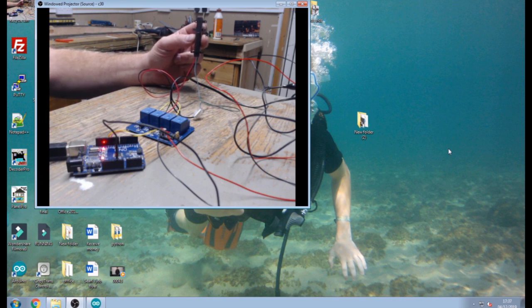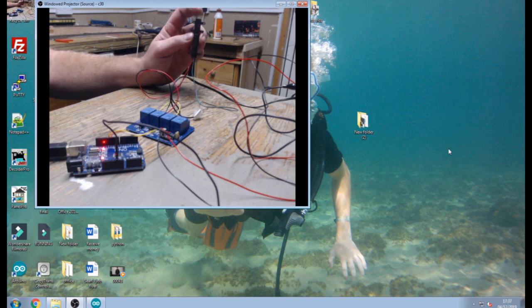These run on 16 volts AC according to the paperwork. I have run one at a little bit lower voltages and I'm going to be trying to run one a little bit lower than the voltage they're putting out, because these still get quite warm even with the amount of pulsing. In this demonstration, it's probably not the practical way because you wouldn't be turning the turnouts on your layout on and off as much as I'm going to be doing during this demonstration.